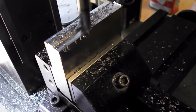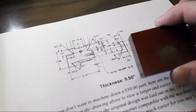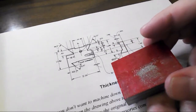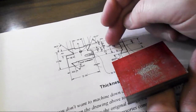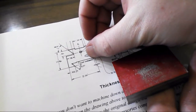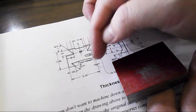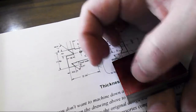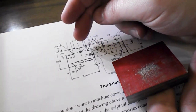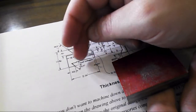I'm going to end up cutting the dovetails. What I plan on doing here first is just some general layout to do some roughing. I'm going to lay out this dimension that shows from this top surface down to the bottom of this dovetail, so that way I can rough this area out and over from this side to the corner of the dovetail. I'll also probably do some more roughing out over here on this step, but for now I'm just going to focus on here.